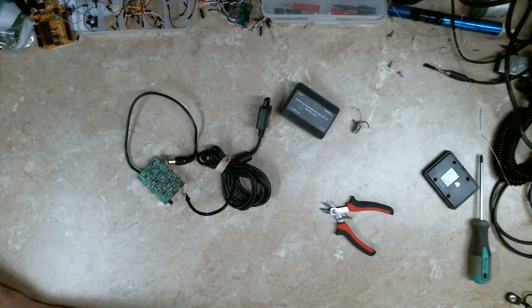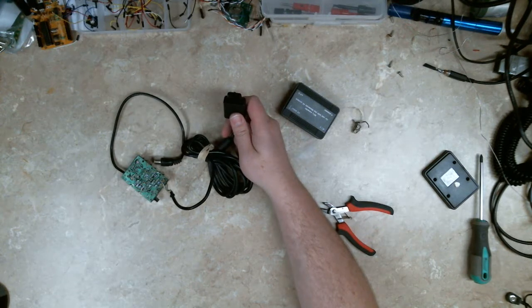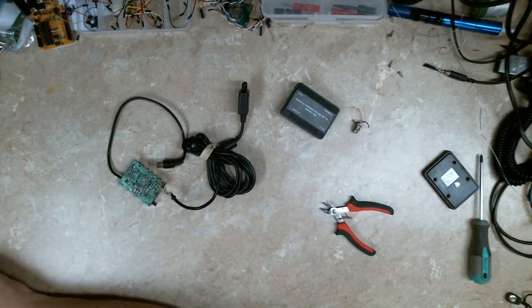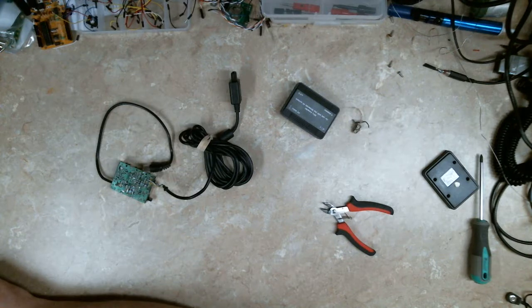Yep, gamesx.com wiki has the pinout right here. And this little plug here has RGB outputs, composite sync, ground, S-video chroma, S-video luma, composite video, 5 volts, and left and right audio. So clearly this is just using the left audio output to the TV. And a 75 ohm resistor to composite video and a 220 microfarad capacitor in series is recommended for composite video input. Okay. Sounds reasonable. I can do that. Now the question is, what colors are the wires? Have they bothered to label them?